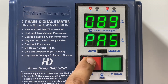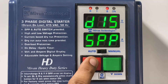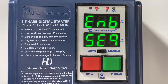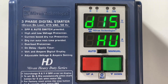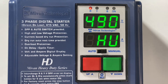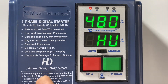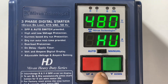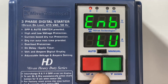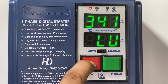Press the set button for 5 seconds, enter password: 90. Press the set button — here you can enable and disable SPP protection by the up and down key. Press the set button — here you can enable and disable phase sequence protection. Press the set button — here you can enable and disable high voltage protection. If you enable high voltage protection, it will ask for the high voltage limit. Here you can adjust the high voltage limit. Press set multiple times — here you can enable and disable low voltage protection. By pressing up and down key you can enable the low voltage protection. It will ask for the low voltage limit — here you can adjust the low voltage protection limit.